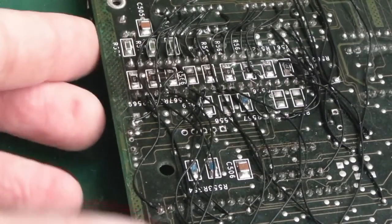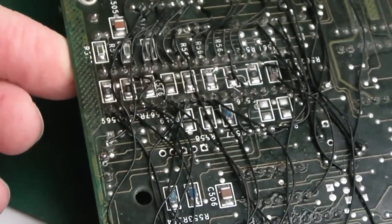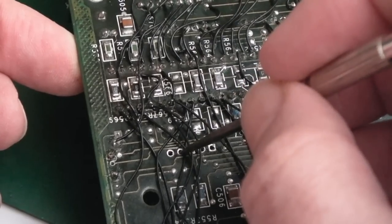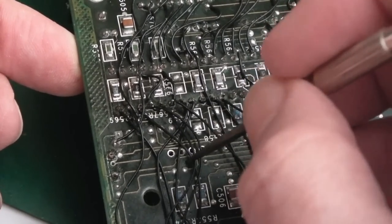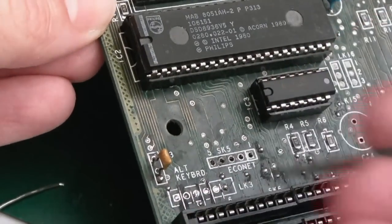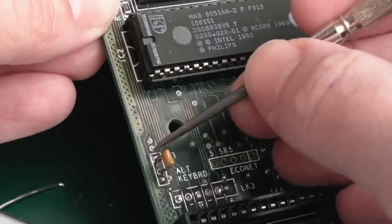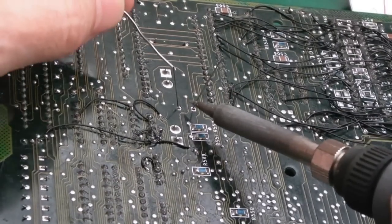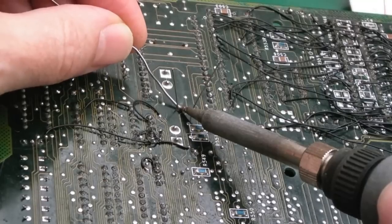You can see now why these wires, I left them longer, because when we come to solder this connector here, I can literally just carefully move them, solder one, and then move them another way and solder another, etc., without damaging the wires. But you can see the solder has flowed on this side here. Final component going back on here now, and then I can scrub the board.